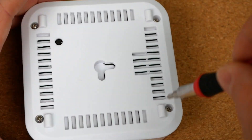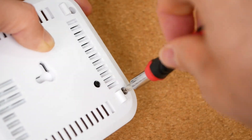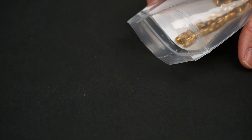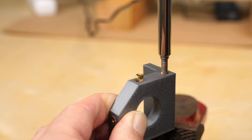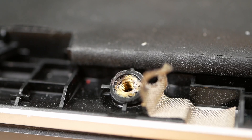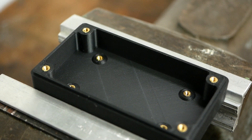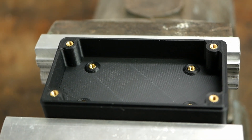Have you ever had a piece of equipment that you disassembled more than once and then realized that the screws didn't bite anymore because all the plastic got ripped out of the hole and now it's totally useless? This is where heat-set inserts come into play — they are melted into the plastic so that you can repeatedly assemble and disassemble your creations without losing any functionality, and you can find them in a ton of professional equipment. If you design something that needs to be robust and where you regularly need to work on, heat-set inserts are a great way to achieve that goal.